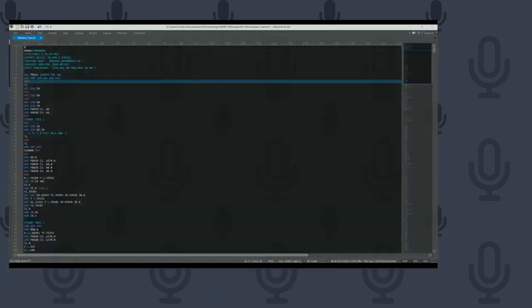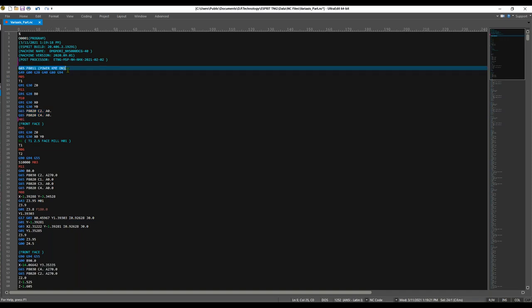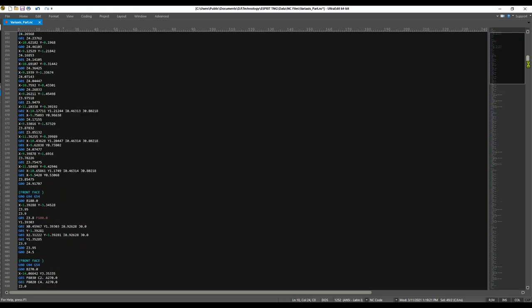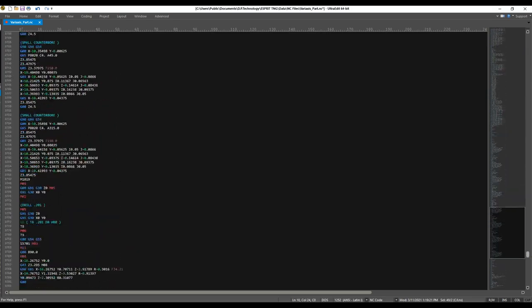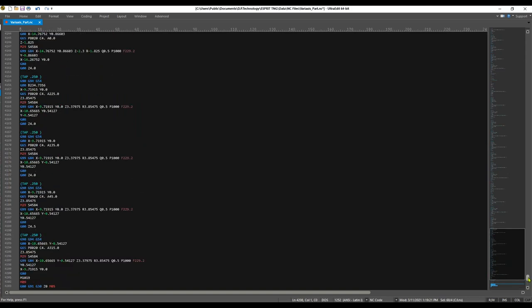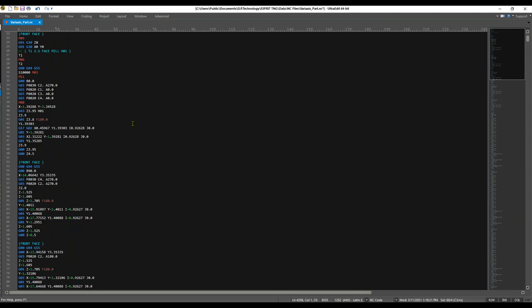While he's pulling that up, there was one other question, about the controller. This is for KME. It looks like you're using your own controller, so do I need to have a fourth, fifth axis controller on the machine? No, you do not. Basically, you don't have to invest any additional dollars to buy Fanuc controllers. Ours is not full five axes, it's positional, so basically it's cut and burn, so you can get to all five sides the best way possible. You don't need to invest in any other drivers. We connect to your actual controllers. The KME keypad is only to set your zero points. Once you set your zero home position, then you don't have to touch that keypad ever again, unless you need to.